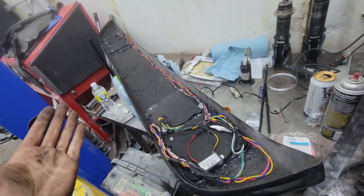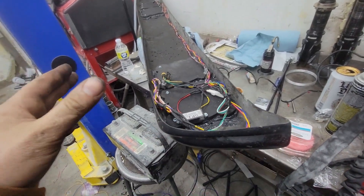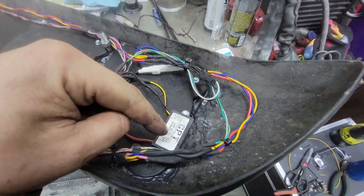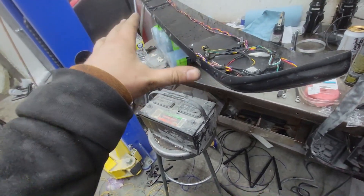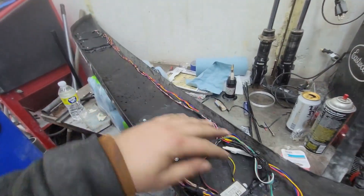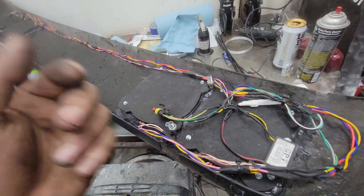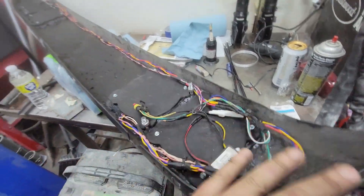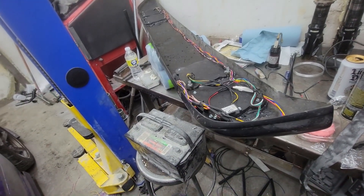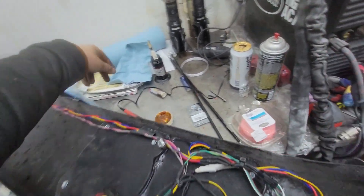I tried really hard and it still looks like mom's spaghetti, so that kind of sucks. My 12-volt to 5-volt converter actually died on me — luckily I caught it because my LEDs were not acting right. I swapped it out and it worked. That could have ended badly because I could have fried all of them and had to solder everything again. But yeah, it's together — let's get it put in. It's three wires on the LEDs.